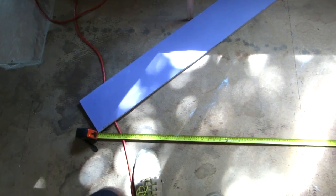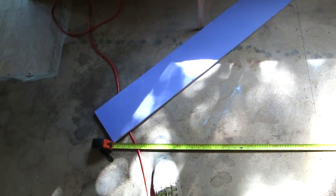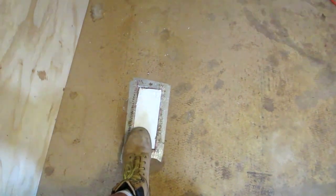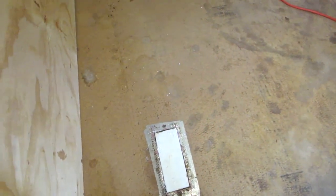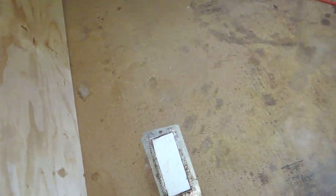So anyway, it's going to come all the way out to here in the middle. I'm not sure that's really going to matter much since I'm screwing it down into this floor. But this whole thing has to be leveled. It's going to be tilted up that way. Everywhere I'm walking is soft in between. I stuck in some 2-inch foam to fill the air conditioning heating ducts because they're trashed. If you saw any of the earlier videos on the bathroom floor, they're collapsed and broken and whatever.